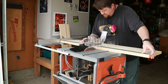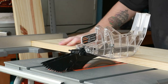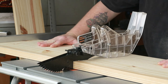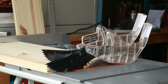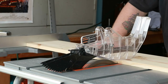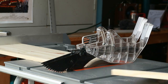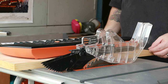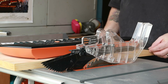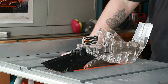After making the cut I've moved the rip fence to cut the top of the stand to 25 inches. Next I'll cut the smaller riser board to 24 inches as well — this will be a brace at the back of the keyboard stand. Now that I've made the cross cuts I need to cut off the bullnose from the long side of each board. I'll check how the keyboard fits to decide how much to trim off. For this keyboard I'll need the top to be 10 inches deep, so I'll set my fence and rip all three tread boards to size.